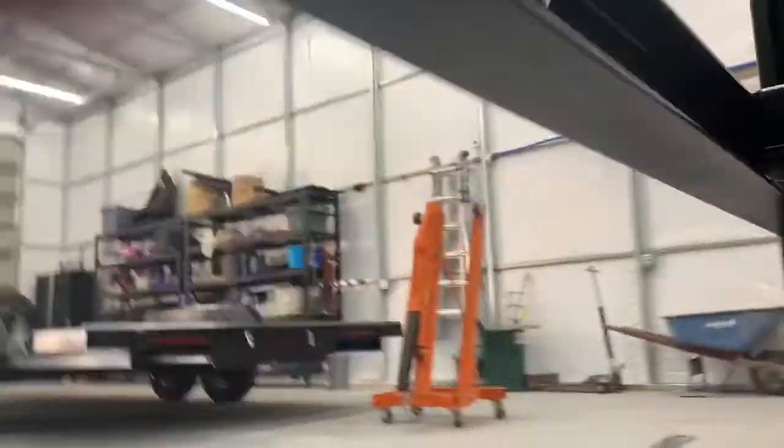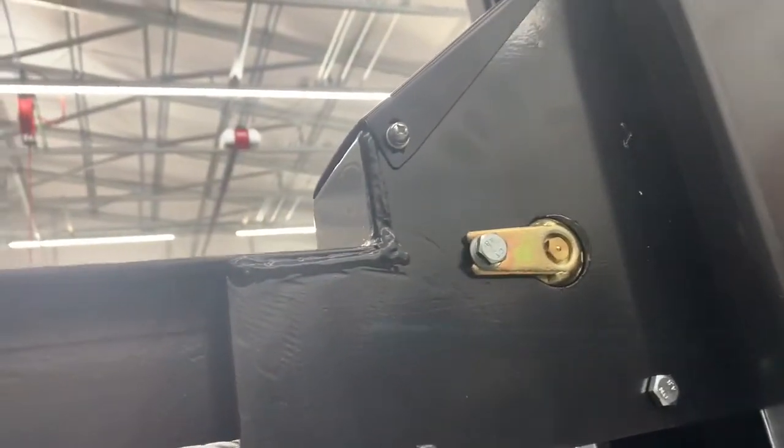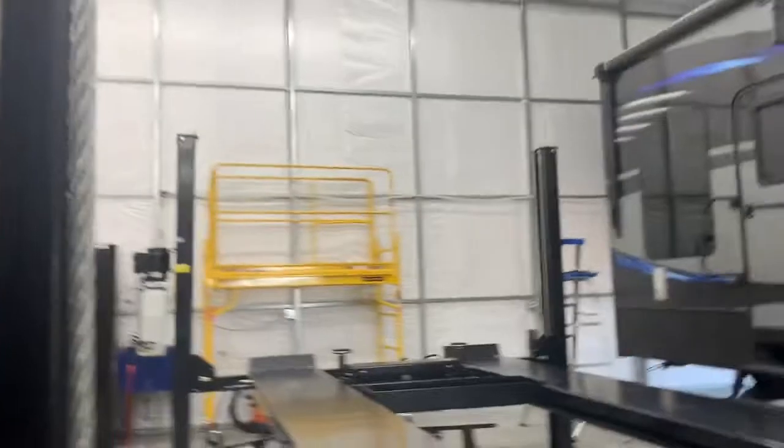The issue is actually on the other side. You've got to get the cable through there, and the bottom is covered up. So you want to create a gap between the two frame members to where you can route this cable out and then up into the pulleys, and it goes all the way to the top. The reason it's difficult is at the very top where it connects, you have the long solid rod piece. So to route that around pulleys you can't do it — you need that gap to push the cable through.